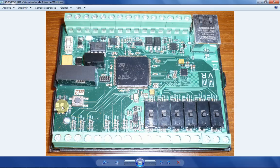Now, when we supply software, we supply two things. We supply bootloader and software. Normally the bootloader does not need to be changed unless something very specific has to be done. So this switch number 1, when it is in the on position, is used. To go into upgrade mode, you move switch number 1 to the on position, press reset, refresh your browser, and you will get the calibration and reprogramming page. So it's only needed on that reprogramming or check, and once that is done, you put your switch again in the off position, reset again, and the unit will behave as the standard unit.